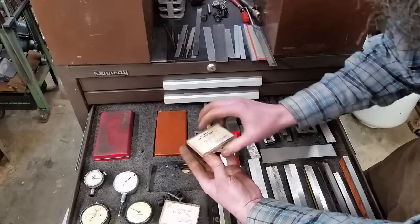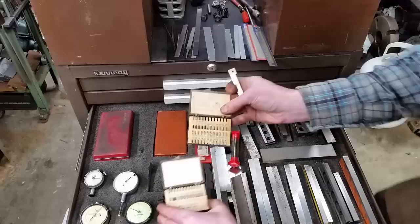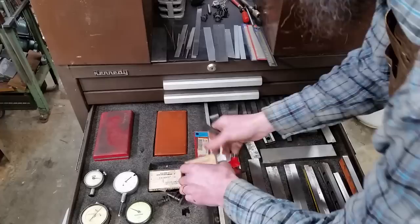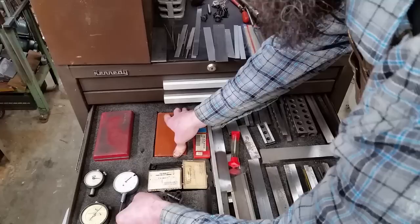These are called thin bits, which I had never seen before — just precision-ground slotting bits. Here's the little tool holder; these are inserts. They range from ten-thousandths of an inch all the way up to wherever they stop. They're just precision little tools that are ground, held into this little tool holder so you can make a precision slot without trying to grind the tool yourself. I had never seen those before. Inserts and insert holder — nothing special there.